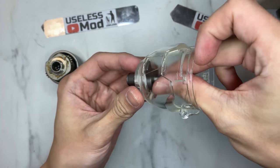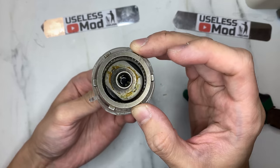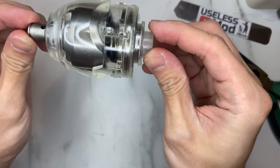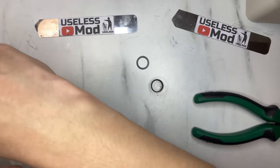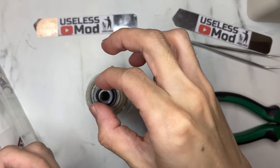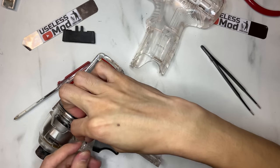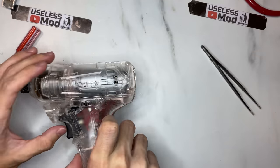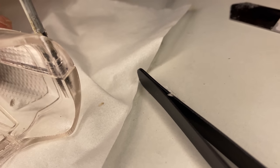Now let's assemble the hammer parts. Fit the bearing back to the cover and put it back — the hammer is now clearly visible. Put back the quick-release mechanism, the two small ball bearings into the holes, then the handle, the spring, the washer, and the retention ring. The final step is to put everything back into the case, including the LED light and the rotation shifter. Put the other half back and tighten the screws — since the screw threads are also captured in the mold, the screws tighten in easily.